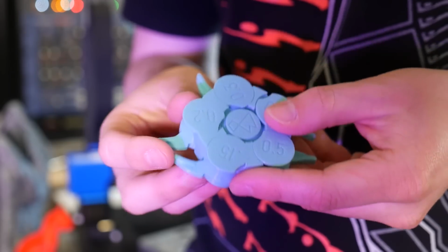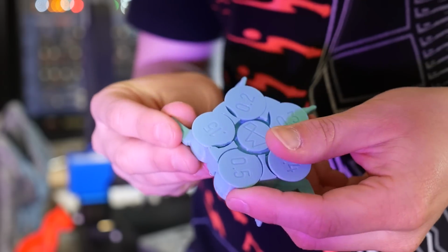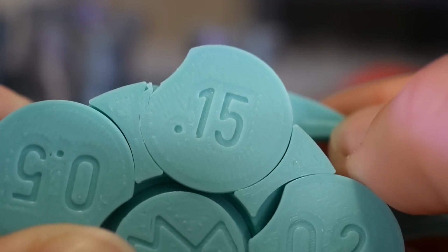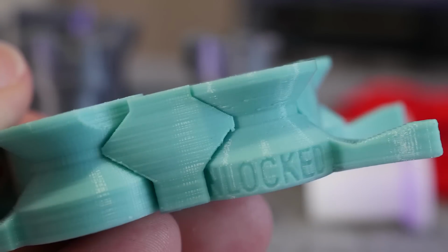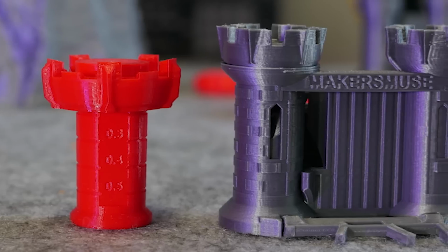On my clearance gauge, I was able to get down to 0.15mm gaps, but only just. It did require a screwdriver to snap the part free, and it was actually still slightly welded in one spot at the 0.15, where the perimeters just barely touched and fused, so there's definitely a little bit of inaccuracy with those extrusion widths.